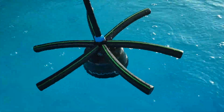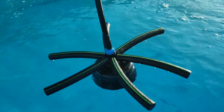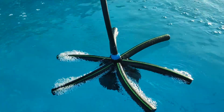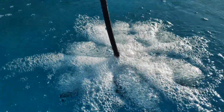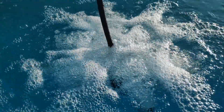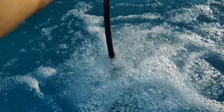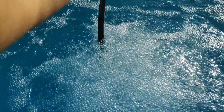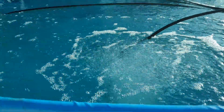The spider box is nothing but aeration tubes, and the total length of each aeration tube is around 1.2 meters. You can see here how the spider looks. For each 30,000 liter tank, we have installed 10 number of spiders to support the aeration system.